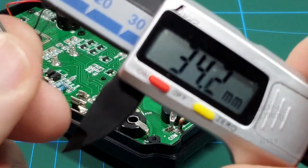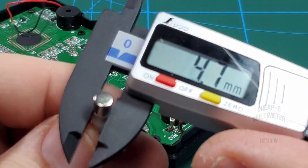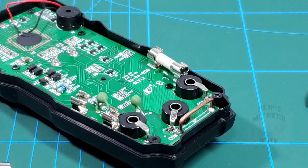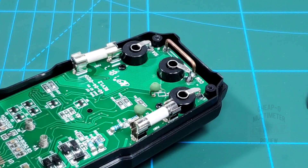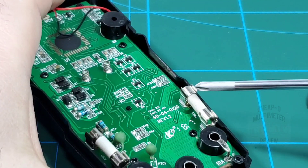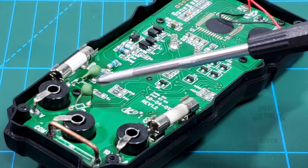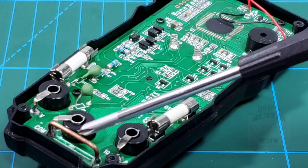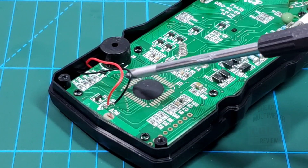On the milliamp side, the fuse is 250-volt 250-milliamp — not even the 600-milliamp they advertise. They are 5×20 fuses, easily accessible, purchasable pretty much anywhere. Too bad the current rating wasn't a little higher than 250 milliamp, especially when they're advertising 600. On the current side there's one 10-amp 250-volt fuse. We also have not one but two PTCs on the voltage side, a diode clamp for current clamping, and a current shunt. It's a pretty sparse board — most of the main control is done by the main IC.